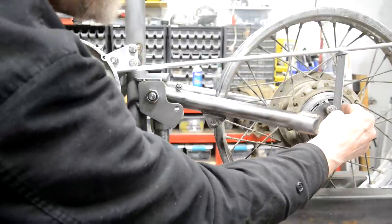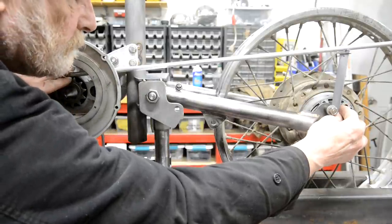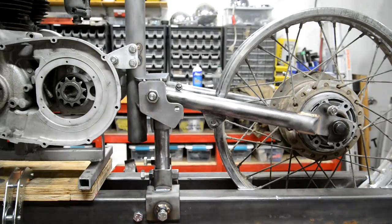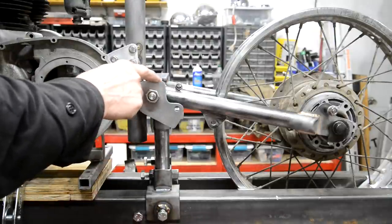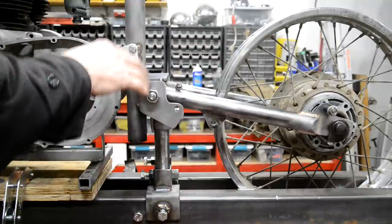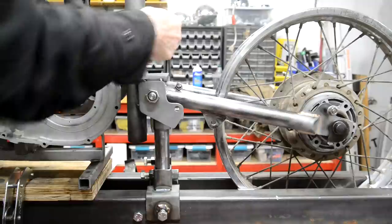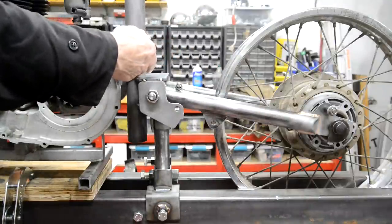There's 6 inches, so we're off the top and we've got plenty of room at the bottom. Okay, everybody happy? So what I'm going to do now is take this back off. I'm going to weld the top and bottom, both sides, then we'll put it back on, set it up, tack it onto here, and then I can bronze, I'll take the swinging arm out, I can bronze in the top